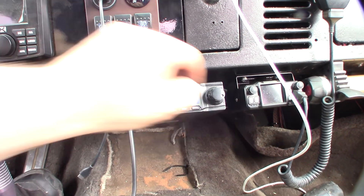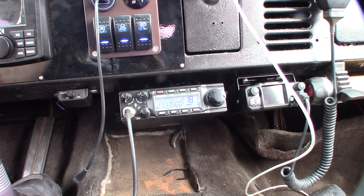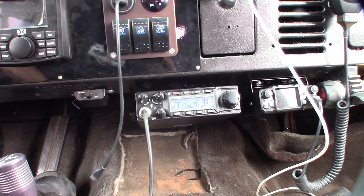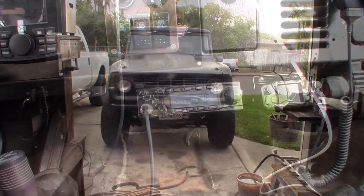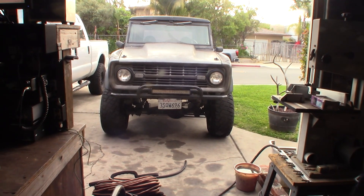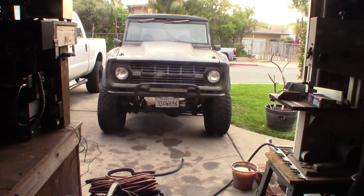It's almost like I need to go to a channel that doesn't have any activity so you can really see it. Yeah, the other day I could actually see the S-meter moving when the pump would go on. Let me know what you guys think down below. I drove this around for the next couple of days. I tested it for about an hour today and surprisingly I saw an improvement — I could hear a lot better. It wasn't the miracle cure I wanted, but it's just small things — chokes, ferrites, and capacitors — all improving the situation, especially on sideband.